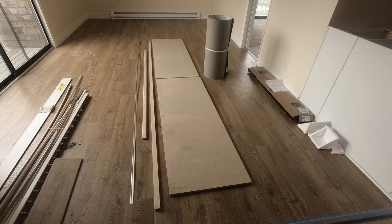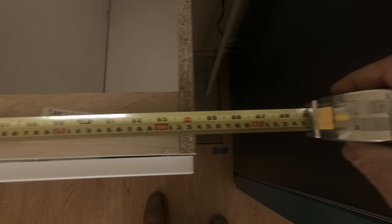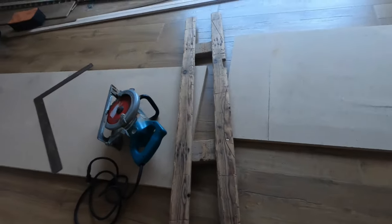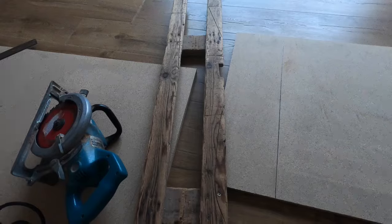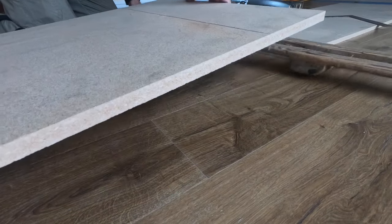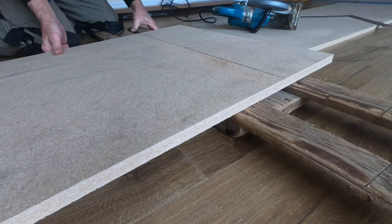I also have an 8 and a 12-foot length of 1x2 for self edge. Both of these countertops are about 5 and a half feet long. The refrigerator will be up against the end here, so I will not be putting a piece of 1x2 on there. I want a quarter inch overhang, which gets me at 64 and a half inches. If you've seen my video on making deck seams, you may recognize the seaming board I use. I also use it to support my work when cutting sheets of particle board or plywood, and sometimes to cradle rolls of sheet goods like vinyl when transporting them. It's a versatile piece of equipment.